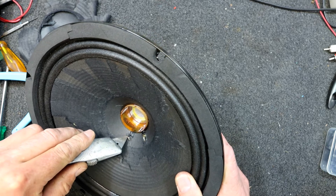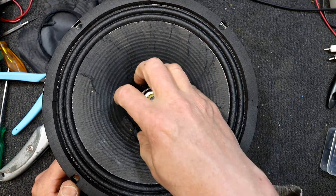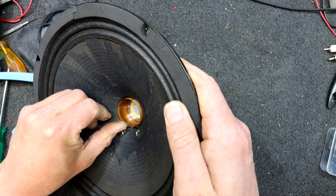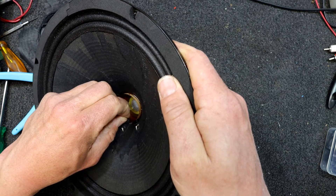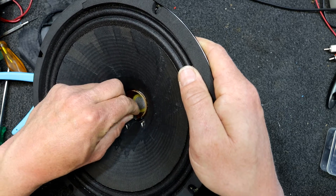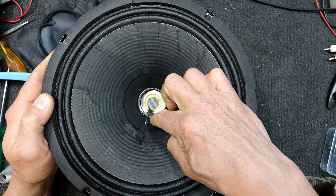Let's see if I can peel that right off without ripping the wire. Often if someone's really cooked it you'll hear it crunching when you press up and down on it, because it's actually burnt the wire and maybe melted the former that it's wrapped around — this plastic thing — and you'll get crunching in the speaker. I think I just broke that off the other one, but it's still attached in the glue. There's a little blob of solder there. I can't see where the wire goes down — I think I just broke it off now.